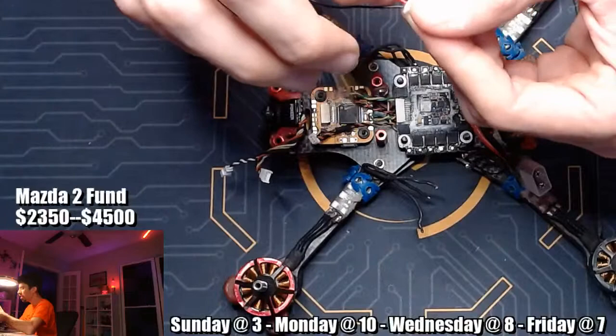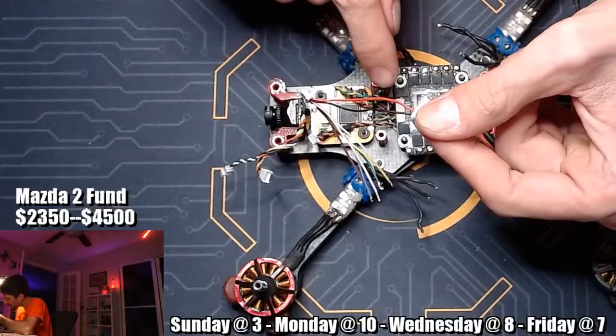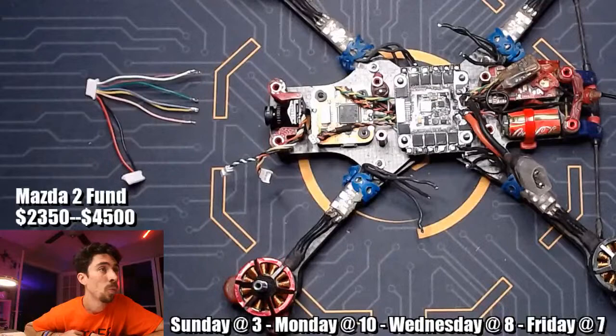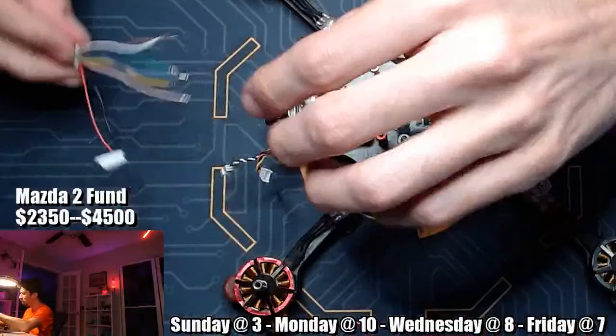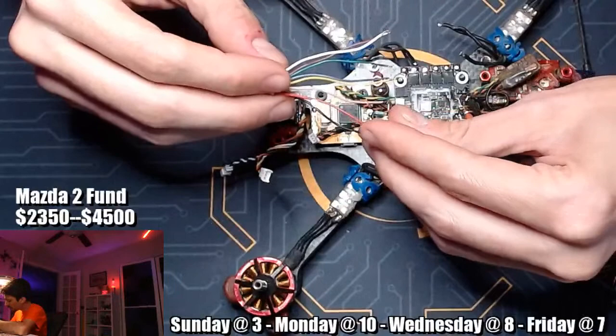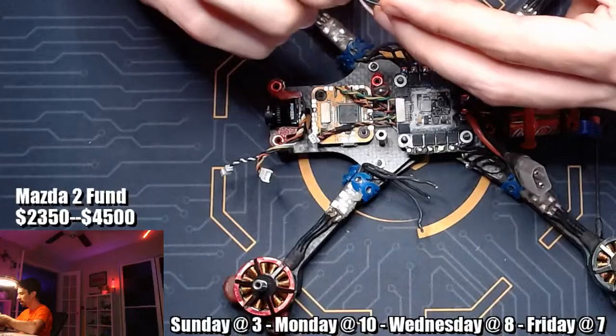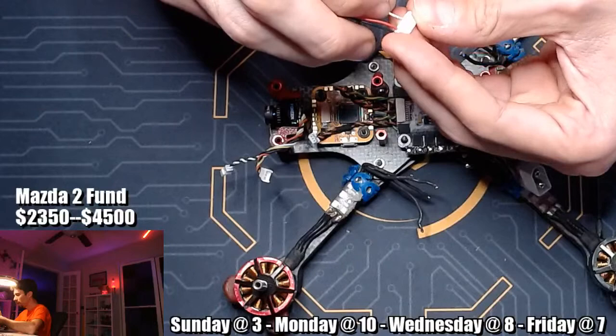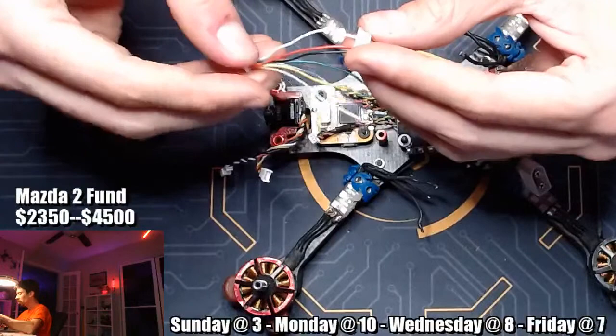And then we're going to skip again, and then we've got motor 4, 3, 2, 1, whereas on the flight controller, how are the motors numbered? Motor 1, 2, 3, 4 from the outside in. Okay, so motors 1, 2, 3, 4 from the outside in. So white is motor 1. So I want white to be 3 in from the outside of the ESC. So that means 1, 2, 3. Okay, cool. Is that the third one in? Yep, that's the third one in. All right, great. So then it's going to be brown, because that's right next door here.